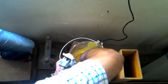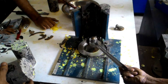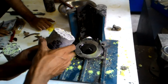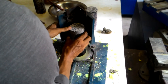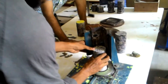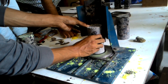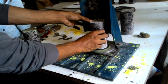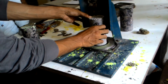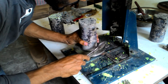When the sulfur becomes liquid, we oil the mold and pour a little quantity of molten sulfur into it. Before it solidifies, we carefully place the cylinder into the molten sulfur. The apparatus makes sure that the cylinder is held in a perfectly upright manner throughout this process. Within a few seconds the sulfur solidifies. We may remove the cylinder by gently tapping on the mold as shown.